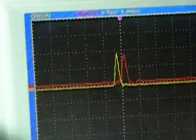And even though the coil load side has stabilized for the power supply, and the driver, the FET input drive side is stabilized, the little scope is still jacking away. Let me see. I wish you guys could see this. It's fuzzy, but you can see the... I wonder if I illuminate the screen. What do you see now? Nah, nope, that's very hard to get. This is a 25 megahertz scope. It's quite slow for the nano pulses that I'm putting in. But you can see it jacking up and down. I'll hold the real still so you can see that.